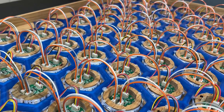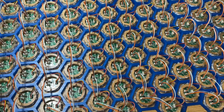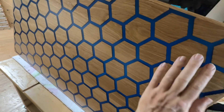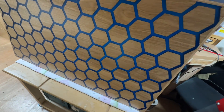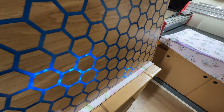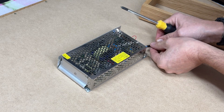This was a position I'd been in before with everything fully wired up. I was a bit nervous to see it working, but I had done some testing and was hoping this would actually work an awful lot better. In this clip you can see everything working perfectly. There was a false activation on a couple of the LEDs at the bottom, but I'd wired everything up in series again, and I think there was an excessive power draw when operating that many LEDs at once — dividing them into different groups fixed that quite quickly.